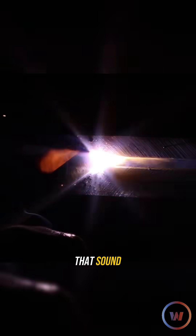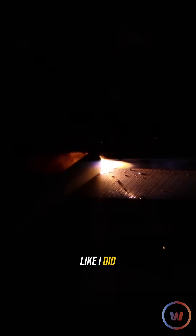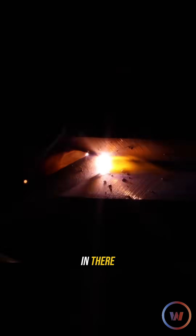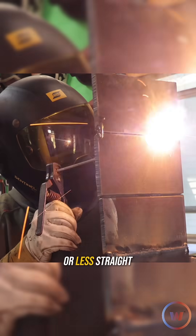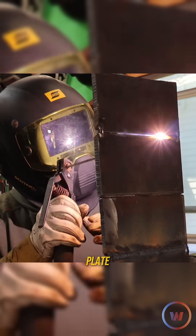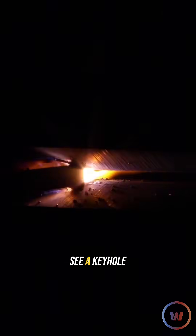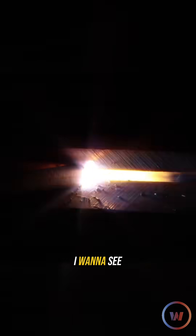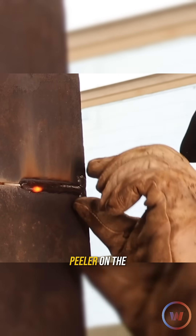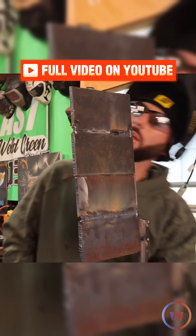You'll notice that sound — that's DC negative in that rod. I'm going to treat this a lot like the 6010: shoving the electrode in there, I want to see a keyhole. More or less straight in angle, trying to see as much light going through the plate as possible, staying focused on my angle. It's hard to see the keyhole — I want to see more of that action go through. I think it's going through okay. Peeling it on the back side — that looks alright.